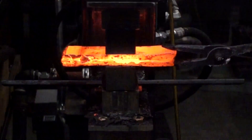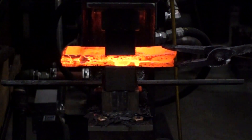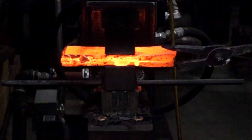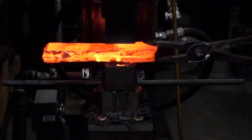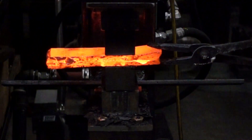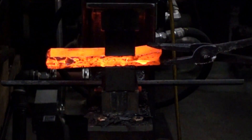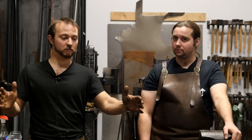Especially if you're using contrasting steels with nickel or chromium, going with a lower layer amount gives you even greater contrast — visible from much farther away. A higher layer count packs everything so tightly together the difference is harder to see. In historical times, using more layers to spread out impurities from less-pure steels made sense. Also, with traditionally smelted materials you have silica staying in, and at forge-welding temperature, as you squeeze and forge the material those impurities get removed — so the more weld layers, the less silica retained.